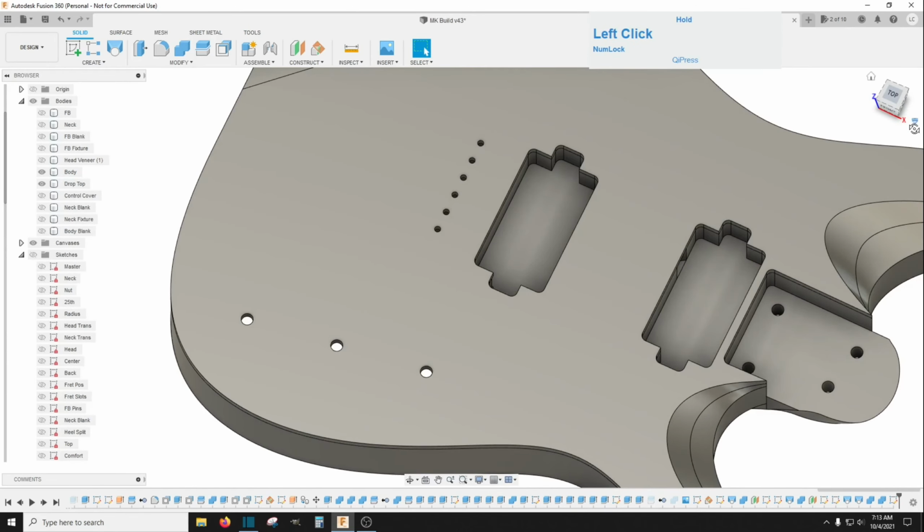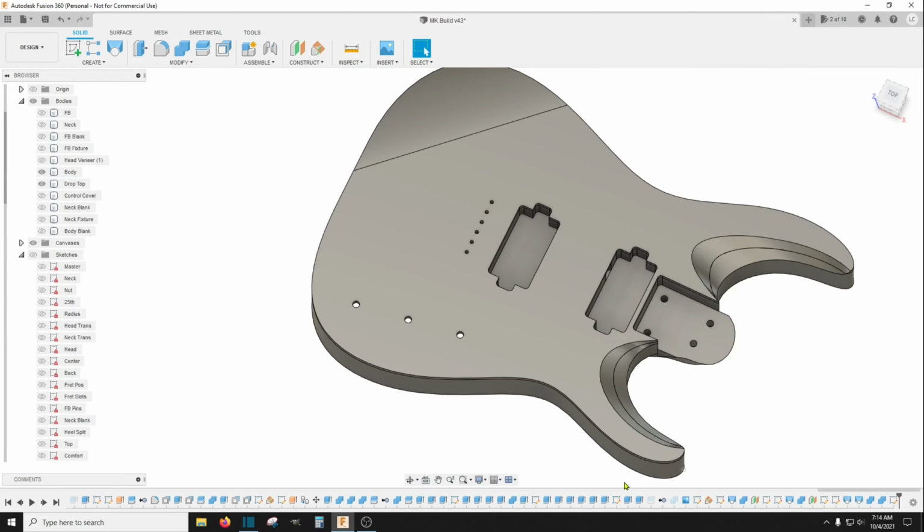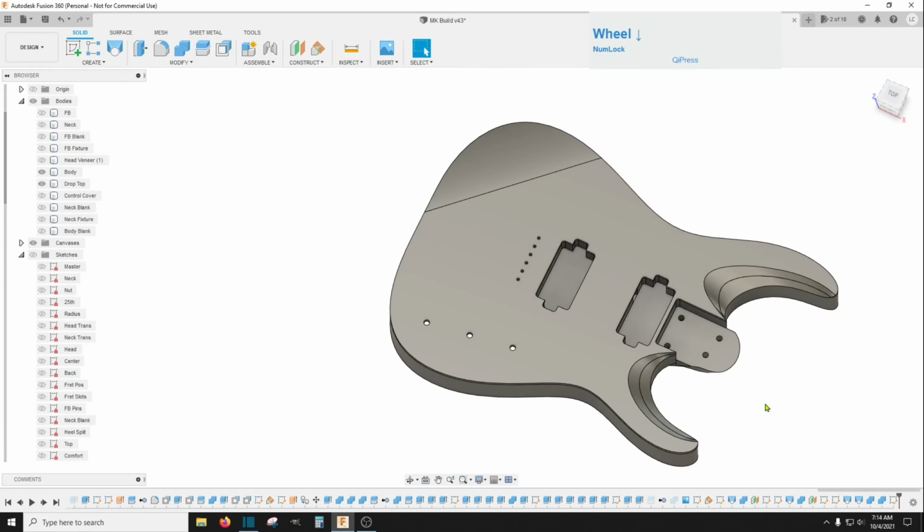And then I did another finish pass, which actually you could do all in 1 finish pass, which would mean you wouldn't have needed that last finish pass we did on these cavities. And I did a finish pass at this depth all the way around everything with a 1/4 inch bit to make all this stuff smooth here. Anyway, you can figure it out just by watching the videos. I showed you all the little hidden trick stuff to do this.